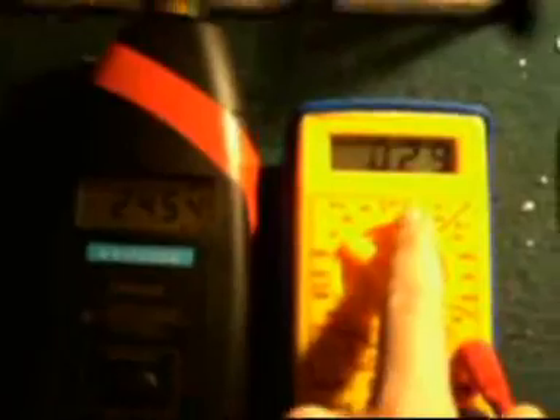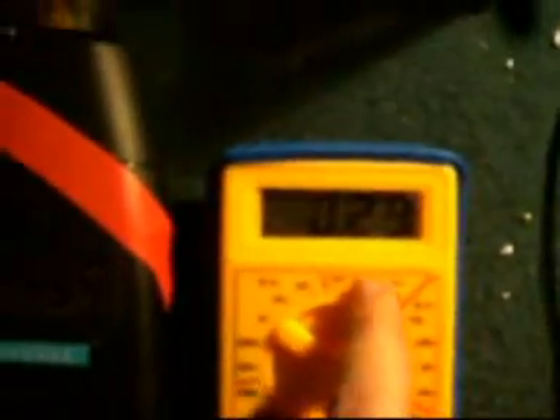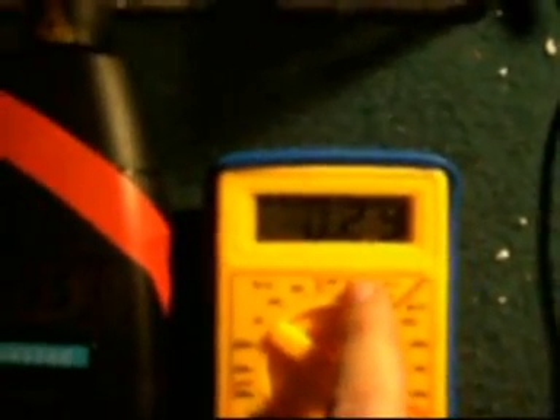There's very, very slow acceleration, which is why I'm showing you once it's got up to speed, because otherwise it's going to take five minutes of the video just watching it accelerate. So here I've got my ammeter — it's drawing 290 milliamps at the minute and going at 2453 RPM, which is pretty good.